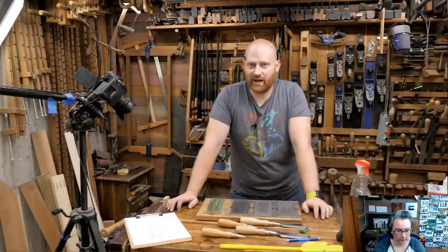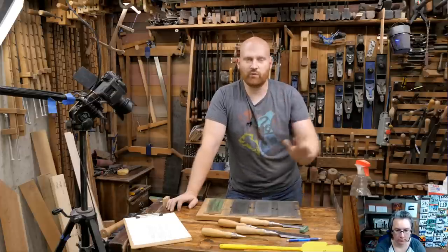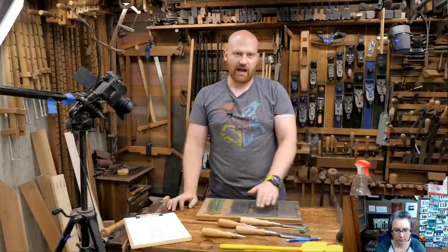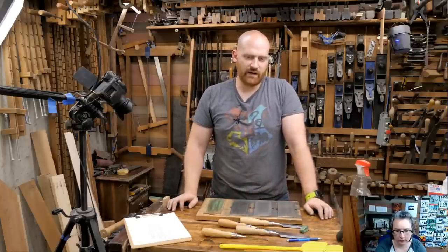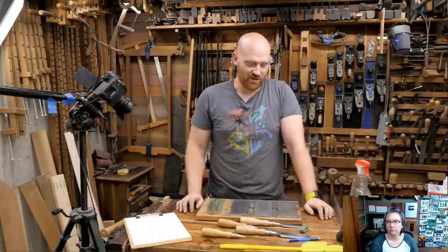It depends on what you have. If you have fine wet stones already, then get a coarse stone. A coarse stone is great for removing a lot of material very quickly. And usually that's the way I do it. I get the edge to the shape I want with the coarse stone, and then I do the medium and fine to clean it up. The coarse stone is nice, because I can use it to flatten my wet stones if I still have those. It just cuts through material very, very quickly. And so usually I'm going to tell people to get the coarse stone first.